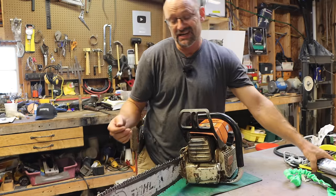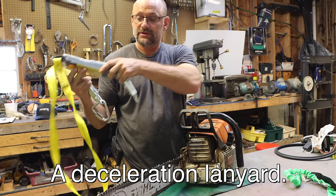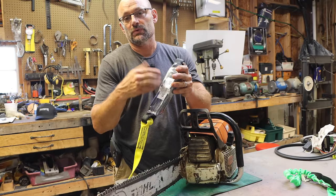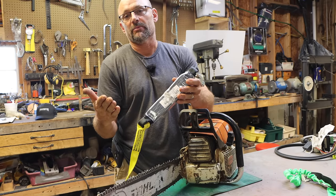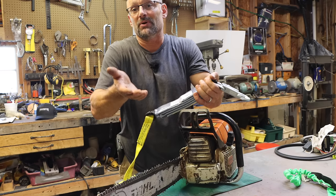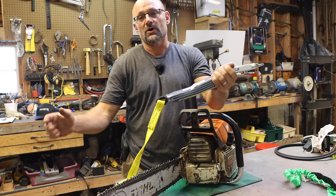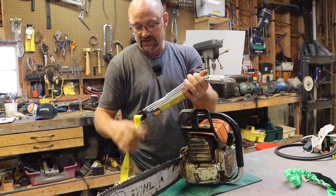And at his suggestion, I got something that I've known I needed for a while. I've just been strapping in with a piece of webbing. This is a lanyard with nice big aluminum hooks on it. The special thing about this is it has this zigzag in it, designed to start to extend out when 900 pounds of force is put on it. Now, this thing's not going to break at 900 pounds. It's not going to break under your body weight, no matter how hard you fall. But if you're really getting thrown hard, if the lift catapults me out and it gets to the point where it's pulling 900 pounds against me, this is going to start to extend and absorb that energy and cushion your fall so that you don't just get to the end of your tether and snap back at the lift. So that's another nice addition, and I'll be using that in the future.